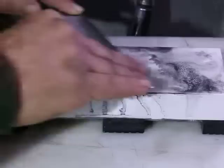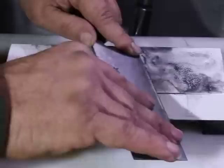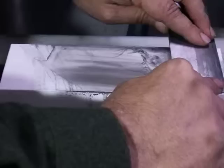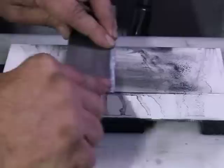I'm going to bring the angle up a little bit — listen to the pitch change. You can hear the difference: I'm now cutting into the edge, as opposed to right behind it, and getting some burr formation by doing that. This method of changing the angle just a little bit at the end is sometimes referred to as sneaking up on the burr, where we purposefully avoid burr formation until the final passes.